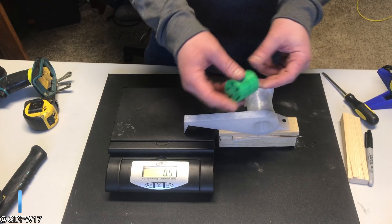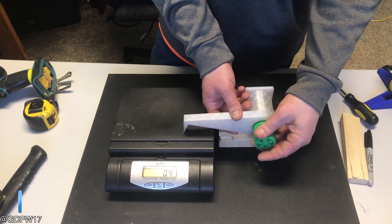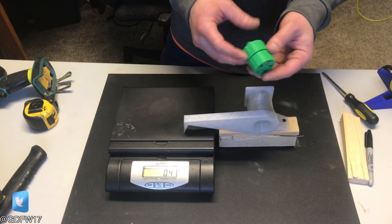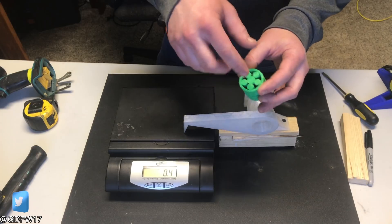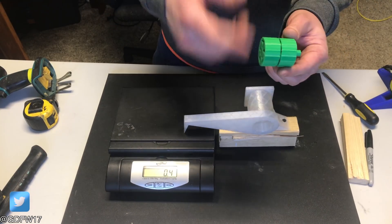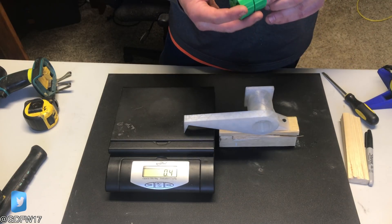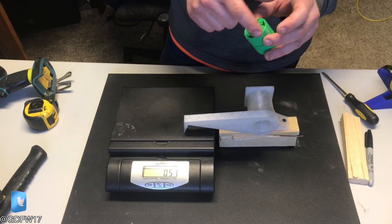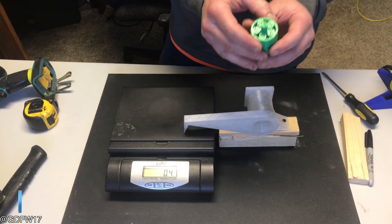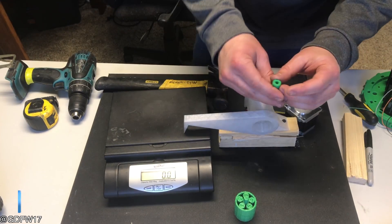This mount has grooves for the side of the gearbox, and then there are grooves for the arm that attach to this part. If I insert this partway, the arm is attached to the gearbox; if I push it in all the way, the arm attaches to the outside ring and the gearbox body attaches to the inside ring. This isn't a typical compound planetary arrangement because it only has two modules, which means these planets could do a twisty action since there's nothing supporting them on either end. I'm really curious whether just two modules will work — using the ring gear as a support to hold the planets in place, since there isn't a carrier to do that.